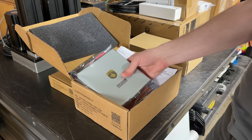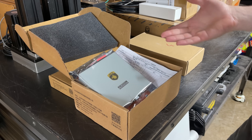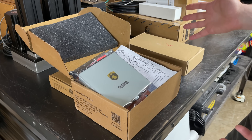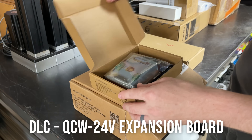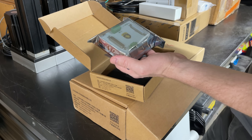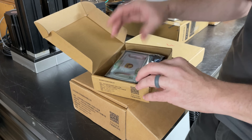The first controller option is made by JCZ — you may have heard of them if you have a fiber laser engraver. This controller is called the DLC2 USB V3.2. I chose this controller — it was really the only option I could find for a controller that came with SLM 3D printing software included for a reasonable price. I also found that I needed to get this auxiliary board. It has the right kind of connections for my type of laser source and the right inputs and outputs that I need.